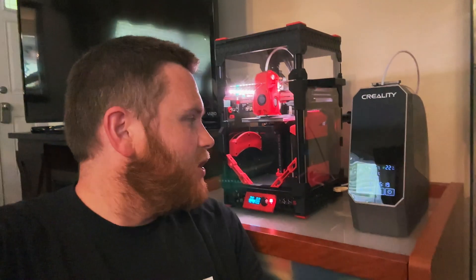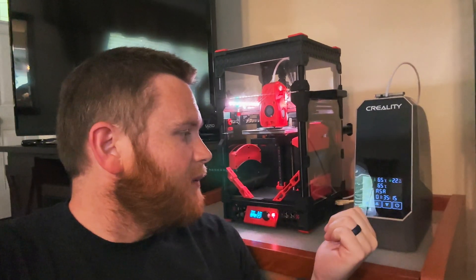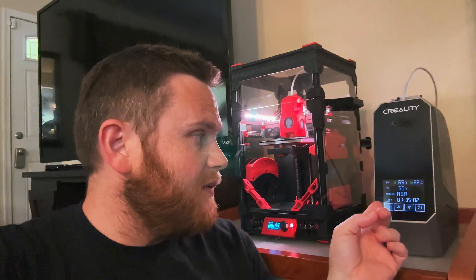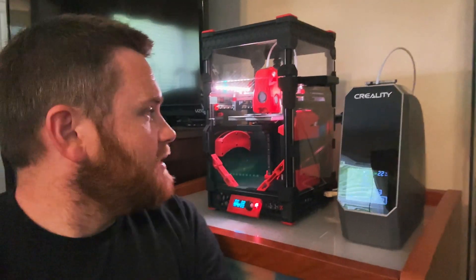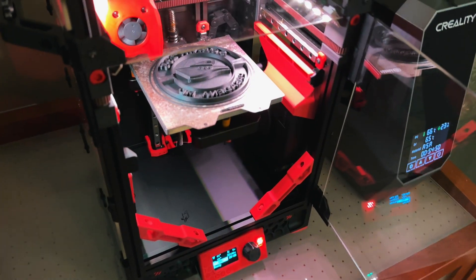Here is my makeshift setup. I went with the Creality filament dryer because it goes up to 65–70 degrees really quickly, and I can get it to and from my car without the filament being exposed to anything. It's sitting right here feeding that ASA carbon fiber by 3D Max right into the V0, and it is chugging along. Let it finish up and see what it does.